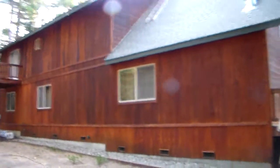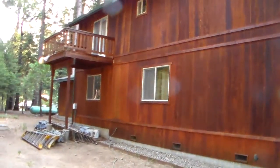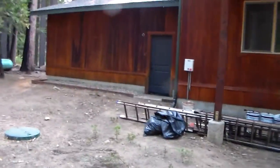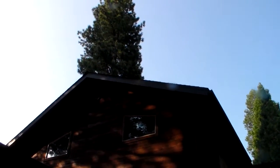It's plywood. It tends to do its own thing. Some pieces are dark, some pieces are light. It does look good though. It definitely looks good. So this wall's 2 or 3 coats. Some of the wings and stuff up there are 4 coats. But again, it's one of those things where you can't really put a number on it. Sometimes it's just what has to be done to look correct. And then it dries out. It'll take about a week or 2 to dry out. That looks nice up there too. So we did trim. All that fascia right there is done.